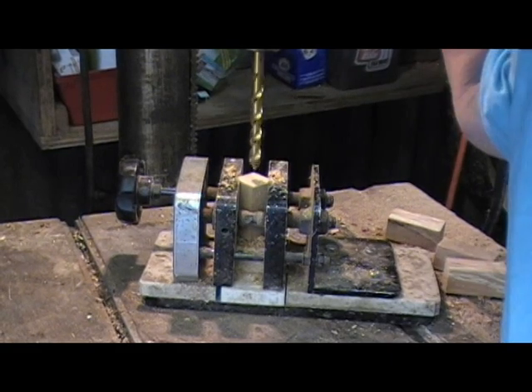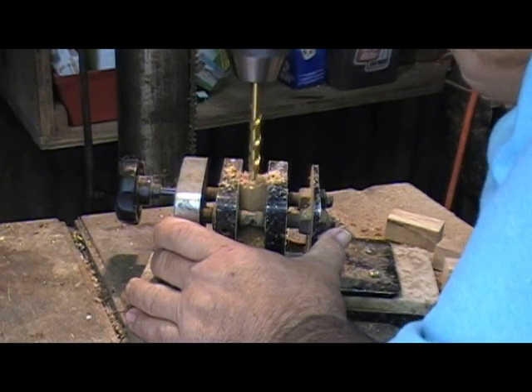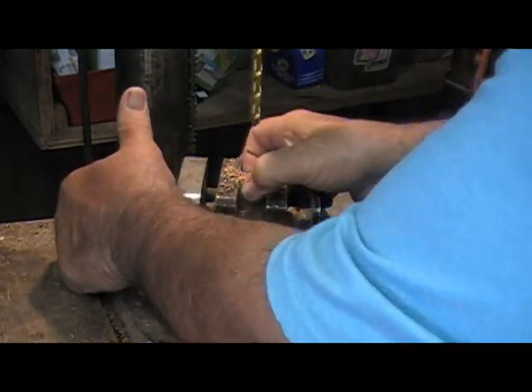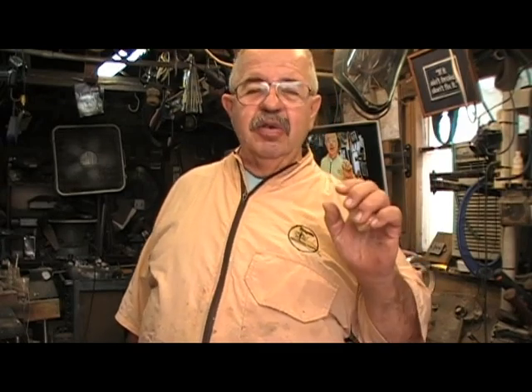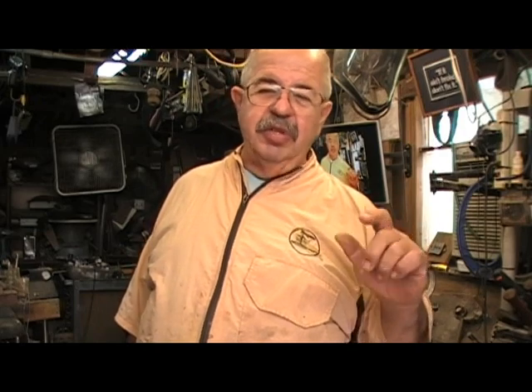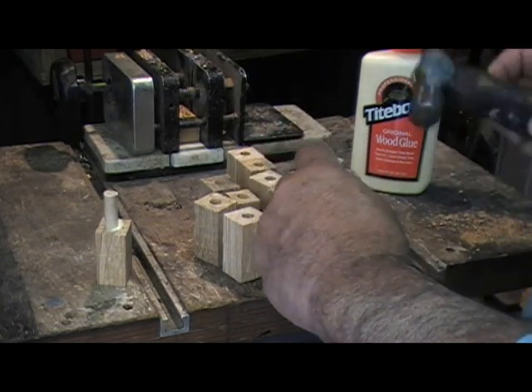You do want it to look like a light bulb. I started with that block, then I took it over to the drill press and used my pen chuck to hold it to drill it straight in — only going about one inch. After that I need something to hold it, because right now all I have is a block with a hole in the end. So I cut some 3/8 inch hardwood dowels — not cheap ones, I used oak so it won't just pop off — then I glued it in using Titebond original wood glue. No black fingers, no gorilla glue, no foam, no mess.